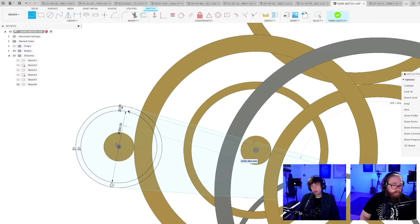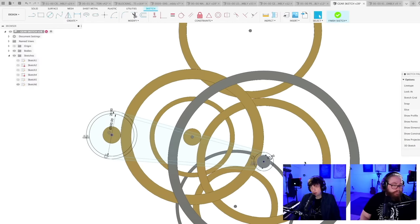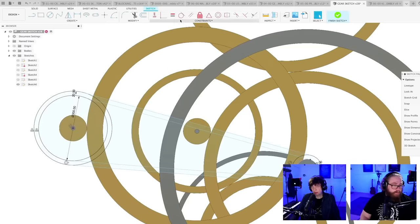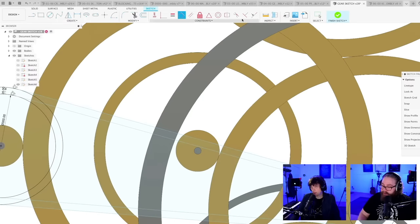So between the crank and the flywheel, we can use a flat belt, just like we did on Marble Machine X. That's super silent. And as long as it transmits, it doesn't have to transmit exact. It has to transmit the energy or the power, but it doesn't have to transmit exact revolutions. So a flat belt here is perfect.